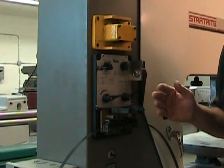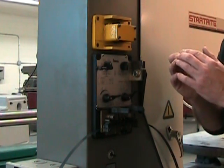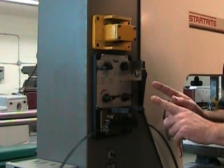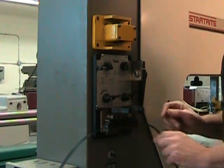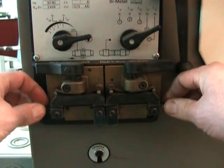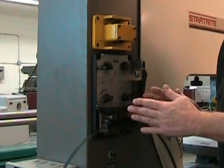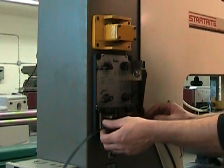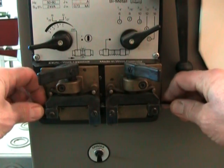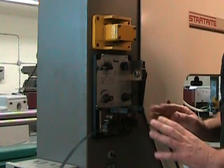We've just welded a high carbon steel blade, and that means that the area where the welding has occurred is very fragile and prone to cracking. So the first thing to do before we do anything else is to delicately loosen the jaws that are holding the blade, and then open or space the jaws to their maximum spacing. That's their annealing position. I can then recenter the weld between the jaws, and with the teeth protruding just slightly from the outer edge of the jaws, retighten very gingerly the blade in place.